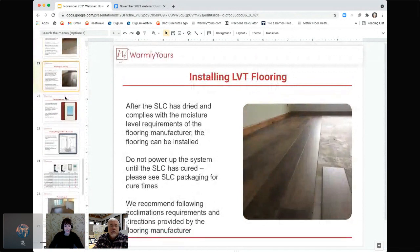Install your LVT exactly as the instructions tell you. Make sure the self-leveling has reached the correct dryness requirement — use moisture probes in the self-leveling to confirm it's dry enough before installing LVT over it. Only test the system with a digital ohmmeter — do not power it up to test. Don't turn the heat on until the self-leveling concrete cures; that could be three days or eight hours — the bag will tell you. Cured does not mean hard enough to walk on — those are two different things.